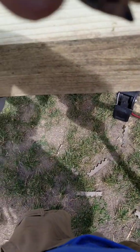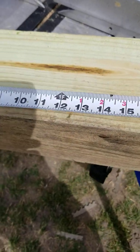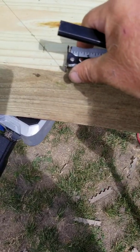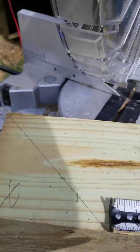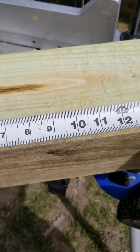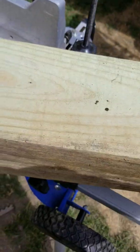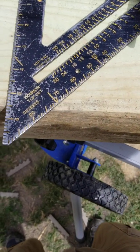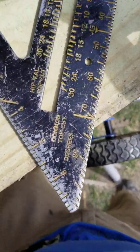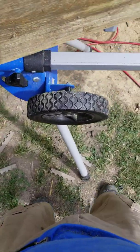I'm going to buzz this guy off right there. I know I need 15 inches for that. I'll set the edge of my tape measure at the end of that line and go to 15 inches — right here. 15 inches, now I'm going to let the angle grow. I bring my speed square over to that mark and let it grow — that's what I mean by letting it grow. Making sure I'm holding the speed square on the edge of the board. Now remember the whole three-inch notch thing.